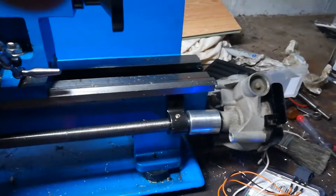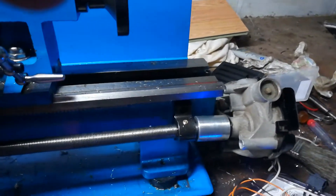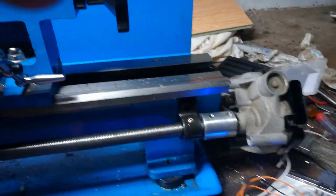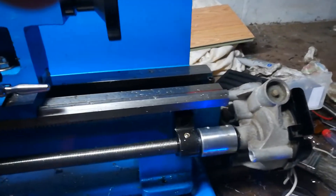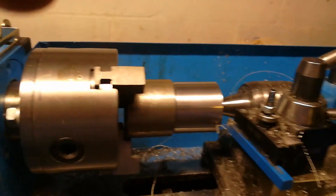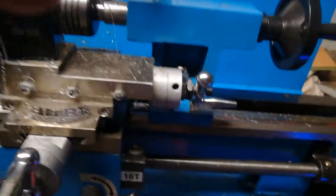Right now this is an aluminum collar I made. I really want to make it out of steel but I didn't have any at the time and didn't feel like waiting to order some. I wanted something a little harder so I could really torque the allen heads — the hex heads — down. So right now I'm in the process of making another one out of steel. I got a piece of steel off a friend of mine and I've been using the lead screw to turn this down.